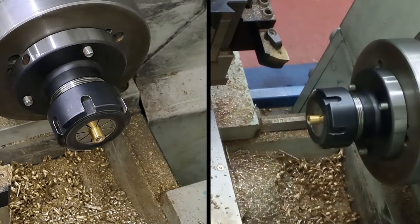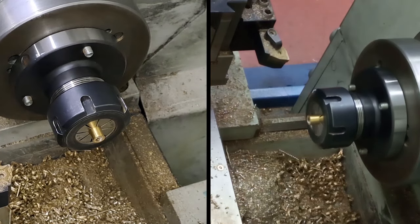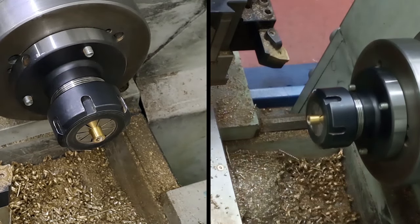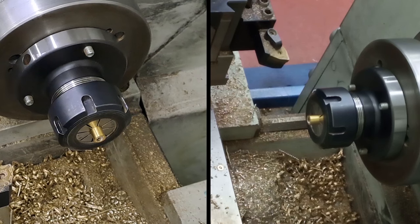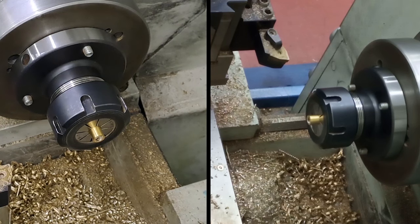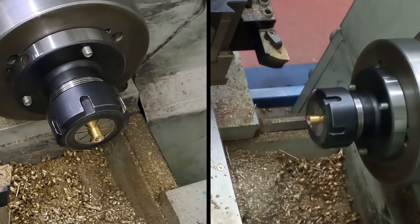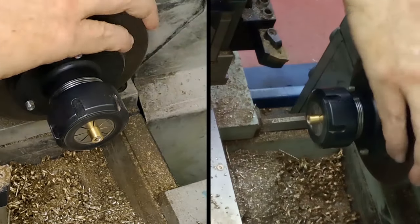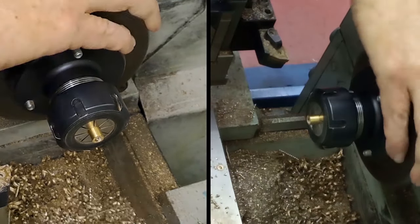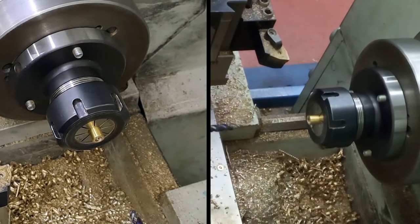There we go. So I'll just take that pin chuck out. As you probably worked out, the chuck on my lathe doesn't go down that small. It can't hold a 3/32 drill, so I had to hold it in a little pin vise and make do with what I've got. And then I can see my little blue line on the tap now. So I'm going to set the machine to 65 RPM. We'll run this in, and once I hit the blue line, I turn it off.